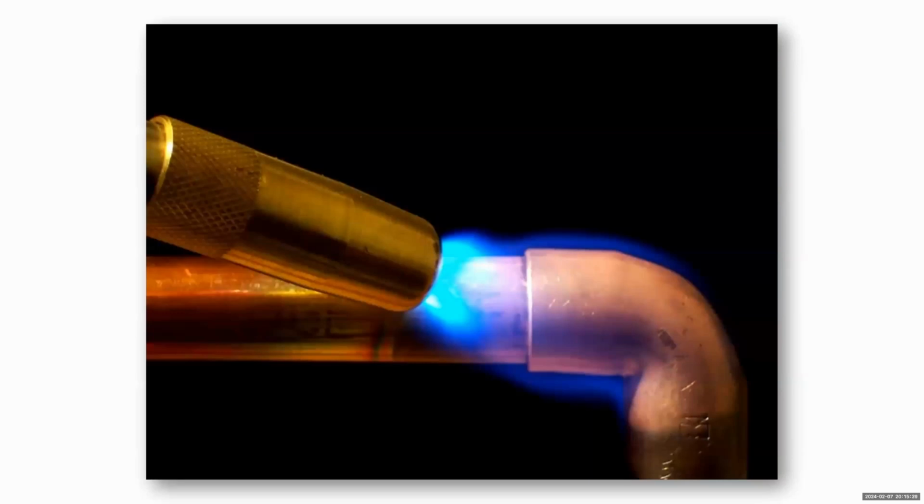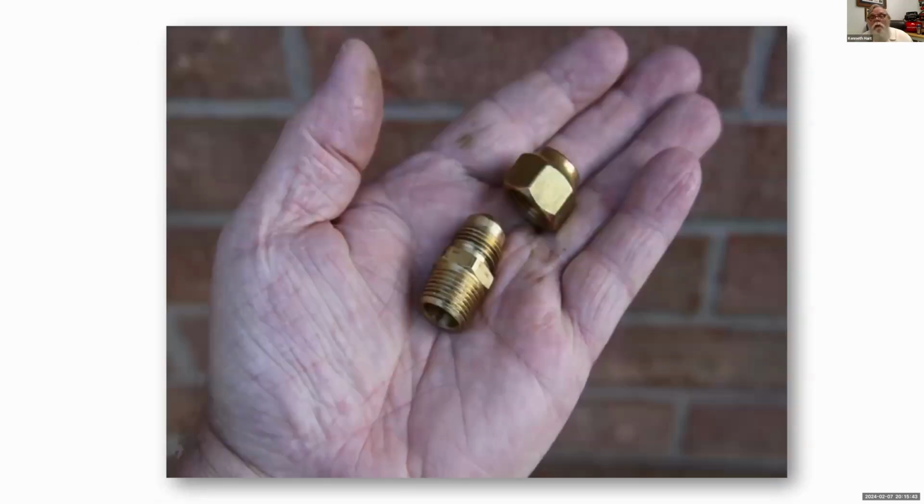Now, if you do need fittings with copper, you're supposed to braze, not solder, the lines. You braze the lines with silver braze, like you would when working on HVAC lines, or you can flare the lines. Flaring the lines is real acceptable. A lot of guys like to do that. Personally, I find more flaring with the plumbers, and I find more brazing with HVAC guys when they switch over and are doing some gas piping work.